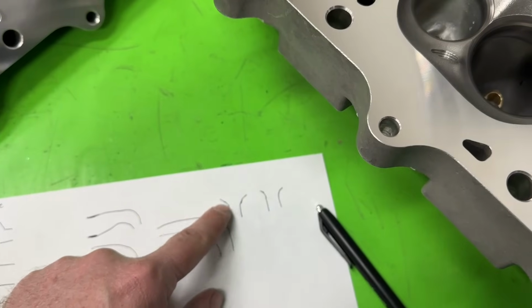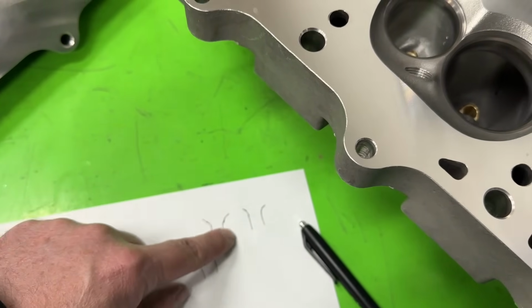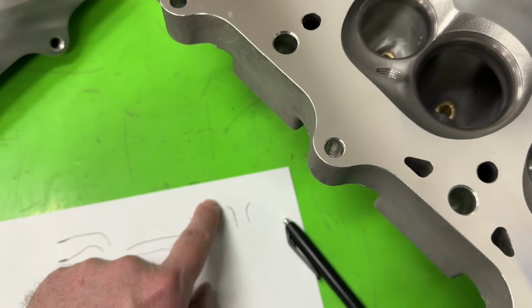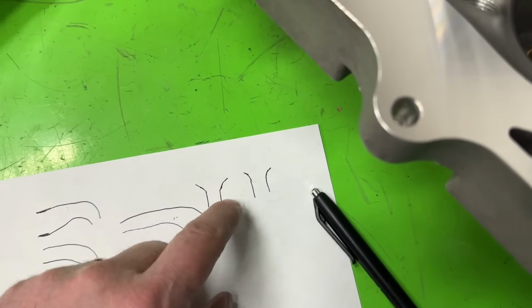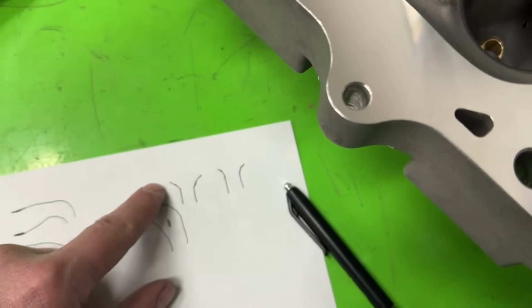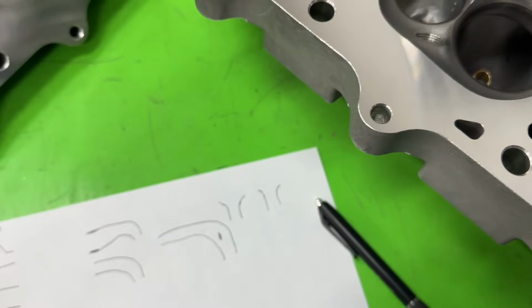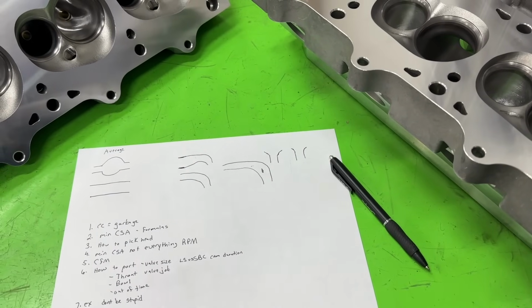If you have a steep valve job like this and you go 91%, you're going to make some super sharp edges. But when I have a steeper valve job, say 50 degree instead of a 45, I can make that throat bigger because it will still have that radius it needs for the air to make the turn, instead of a sharp edge that would happen on a 45 degree valve job. So I make my throats bigger. Here's a small video of me doing the throat so you can get an idea.